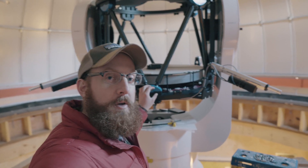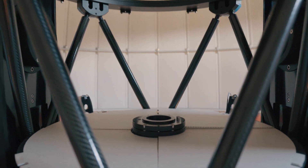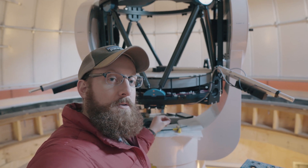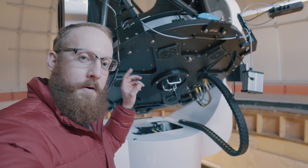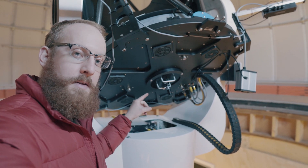We safely removed M3 with the primary mirror cover in place. Next, I'm going to attach the laser adapter to the back plate, then look up at M2, do tip-tilt, and get that laser centered back on the target. I got the laser adapter attached to the back plate. I'm going to go on the ladder and adjust the tip-tilt of M2 until that laser is centered back on the target.